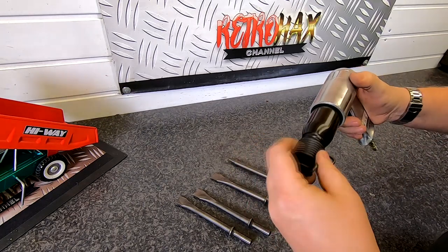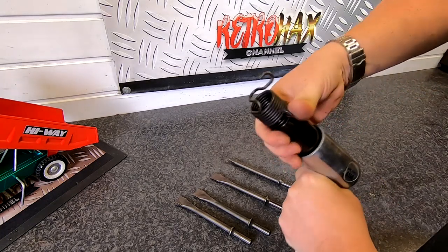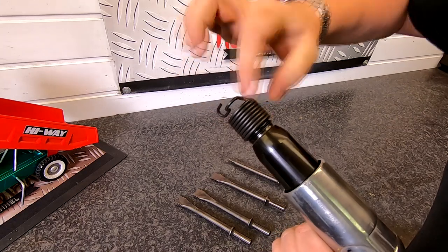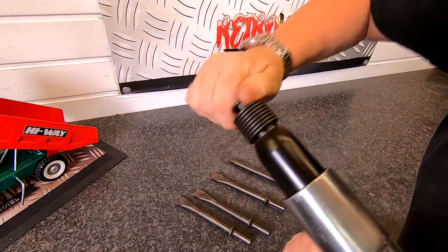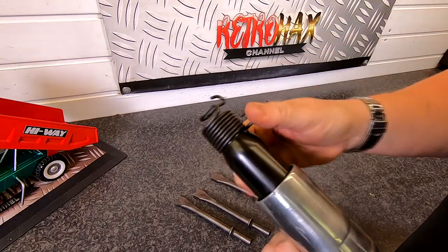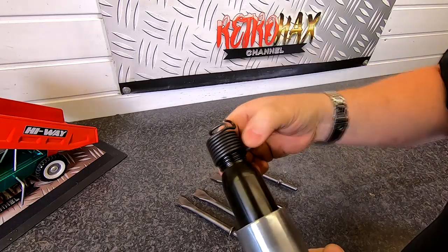The way you get this on - this is where people normally get confused. They try to hold it like that, start turning it on, they might persevere and then try pushing the other tag. If you try to push that one, you're going to hit against the wall because that just tightens around it. The purpose of these two tabs: one you use to wind it on, and as you wind it, it actually opens up the spring because you're tensioning the spring, which makes the spring increase. The other one, when you turn in the opposite direction, tightens the spring up - so you then need to use this one, which has the same effect of opening the spring so you can withdraw it.